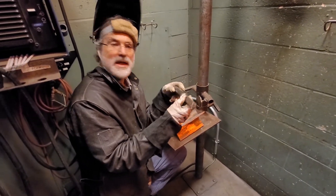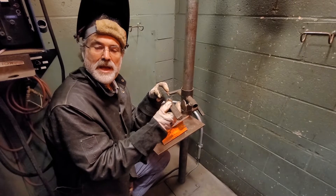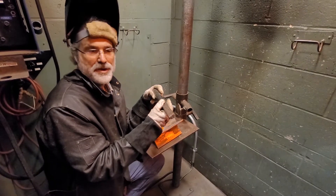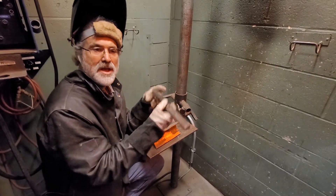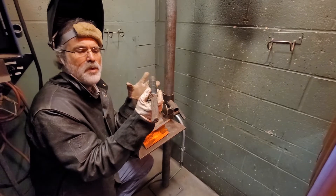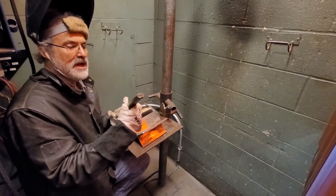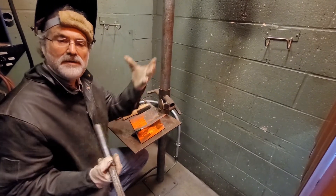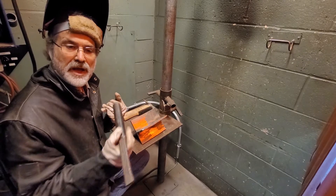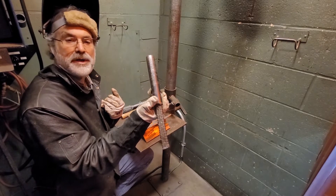Here I have a handle that's made for practicing welding. Whenever we practice welding out of position — which means vertical, overhead, and horizontal — we want to have a handle connected to our plate. Even a lot of times when we're welding flat, we'll connect a handle to our plate. The handle allows us to pick the metal up without touching it with our glove and carry it over to the water trough and dunk it in to cool it down without burning our glove.